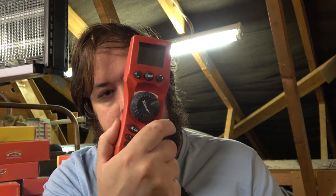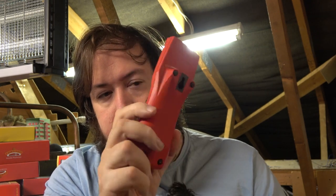You also have boosters which I haven't tried, but in theory it's plug and play. That's the main bus on the ECOS, but one thing ECOS has done to get around the bus problem is the sniffer port. If you have something like an XpressNet controller, you plug that into the controller, then plug the controller's DCC output into the sniffer port on the ECOS — whatever you do on that controller will show up on the ECOS. It takes a little configuring but it's a nice option.